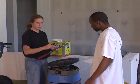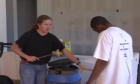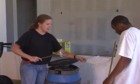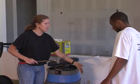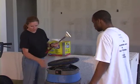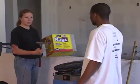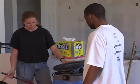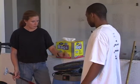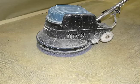Okay, Jamon, let's go over the tools you need. You're going to use a razor scraper. We've got a mop and mop bucket. We've got water and TSP. Just a couple of tablespoons and then fill it up with water. We've got a good floor vac, a floor machine. We have good quality paper towels. Now we've got a black pad, which is a very aggressive scrubbing pad, and a pad driver for our floor machine. It holds the pad in place, and it fits onto the floor machine.